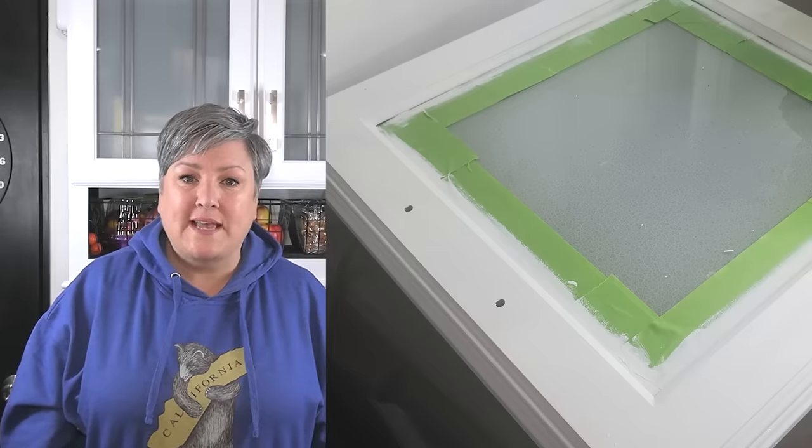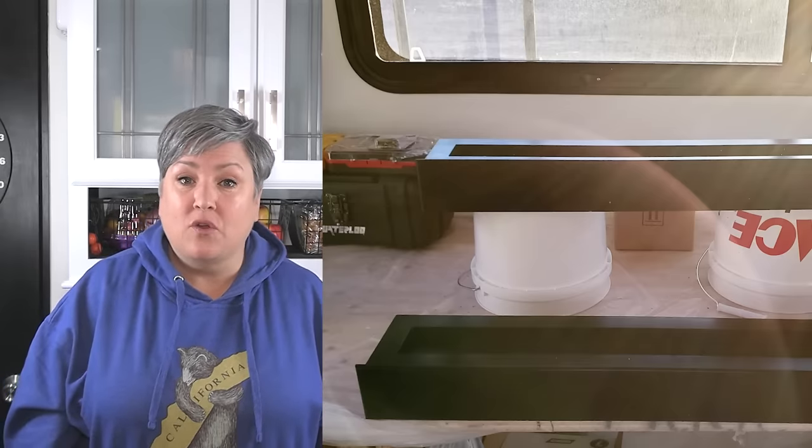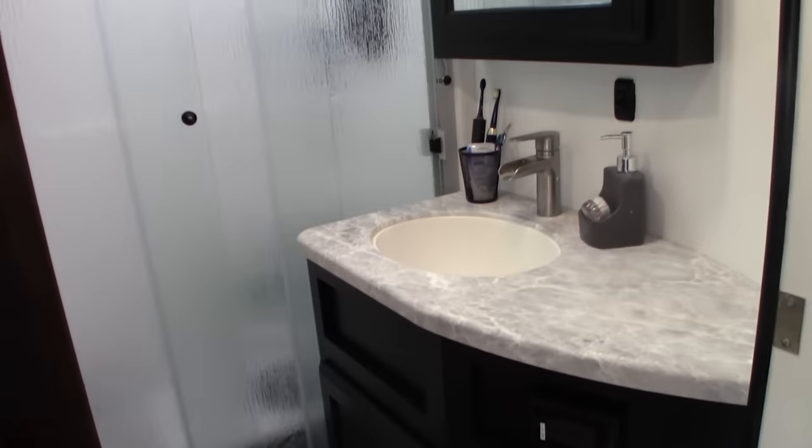Then — and you're not going to want to do this step, but you have to — we cleaned both the walls and the cabinets with Crud Cutter. This is a strong cleaner that comes in a spray bottle. You do have to get protective gloves to use it, but you spray it on the walls, then wipe it off, and then wipe it off again with a clean towel. It removes any grease or dirt stuck on the walls. We were amazed after only living here a little over a year how much dust came off the walls. We did the same thing on the cabinets, then sanded them with a fine sandpaper like a 600. We started to get a little tired and didn't do the best cleaning or sanding a couple of times, and we could really see the difference in the way the paint laid on, especially in the corners. Don't miss this step — it makes all the difference in how it looks in the end.